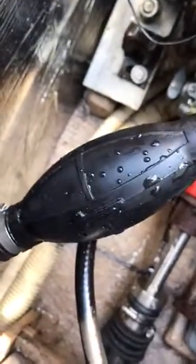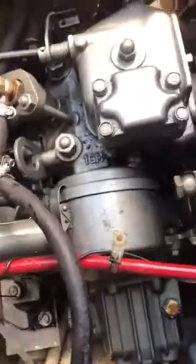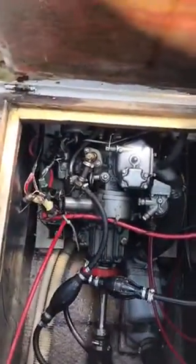And I also had earlier installed this pump, thinking that I could just pull the fuel through the engine. Of course, that couldn't happen because this line was jammed. So I gave a couple of squeezes on this one too, and started up the old engine, and after a couple of little spurts, she started to run like a charm.